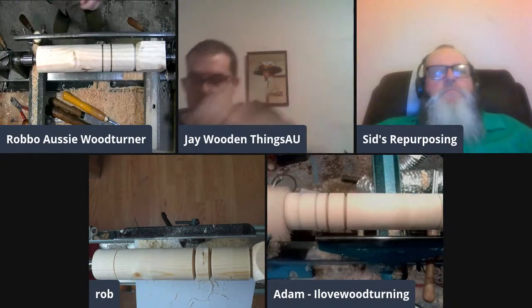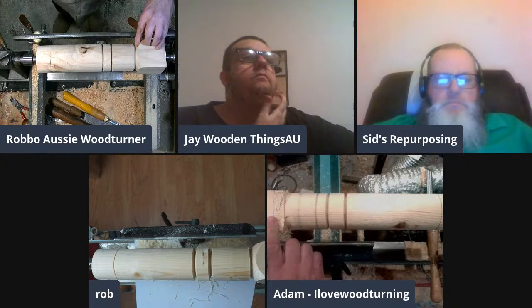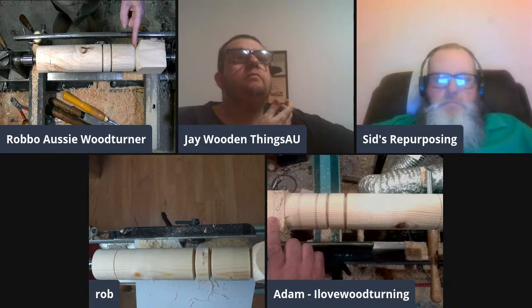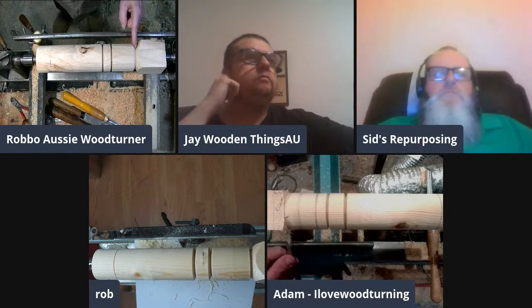Now you've got to make your pommel cut up here. Just have a look at where my finger is. So what you're doing, that 15 mil mark that you put there, it's a straight line. You've got to make that bit in there 3/8 of an inch deep as well. Yeah. So keep that on the 80 mil line. So you angle the chisel out that way, so you get a straight edge down here. And get that 3/8 of an inch deep as well.